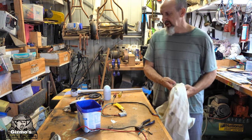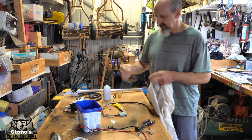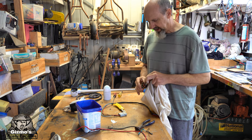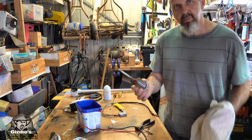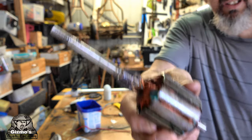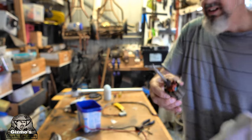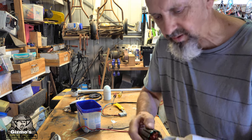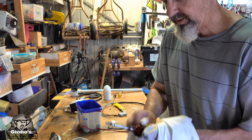Now what I did notice when I pulled it apart was that it was actually full of water. I probably should have done some checking before I went on this trip and reserviced the motor again, but I didn't. But yeah, it's in a poor state. That commutator is just all gooked up with grease and yuck. It's a wonder that the brushes could get any contact at all from that. The commutator needs to be clean and shiny for the brushes to run on, for it to pass electricity through. So that's dirty. So yeah, I'll clean all that off